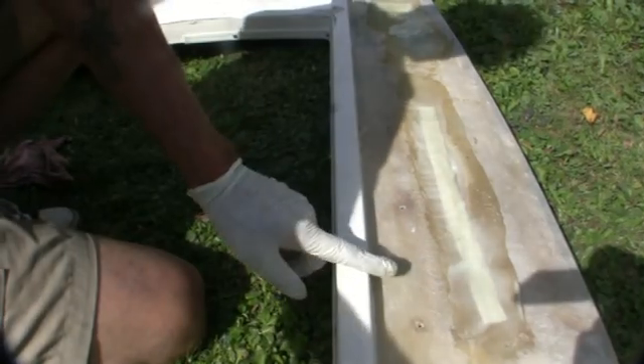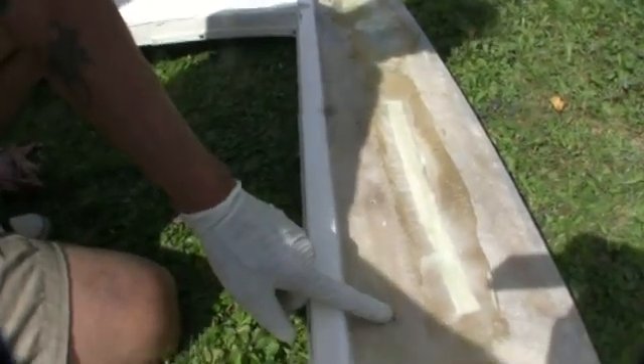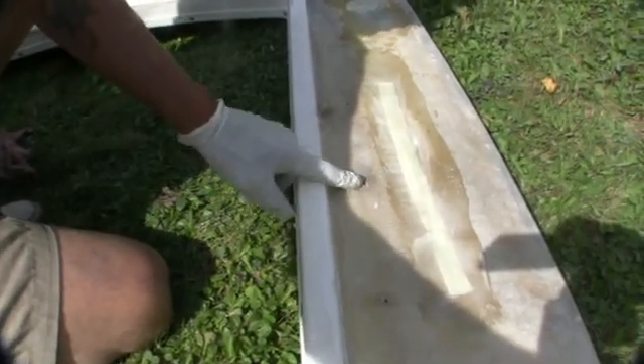We're not done yet. We've got to fill in all these screw holes - see these holes right here, like this one and this one. We've got to fill all these because that's for the track for the hatch on the companionway. They don't line up anyway to where you want them, and they're not perfect. You fill them in with milled fiber and it's stronger than the original boat. So we're going to fill all those back in, drill them out to the next size bigger, countersink them and fill them in.